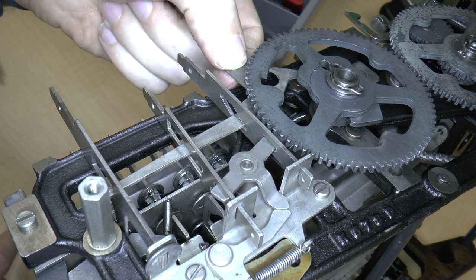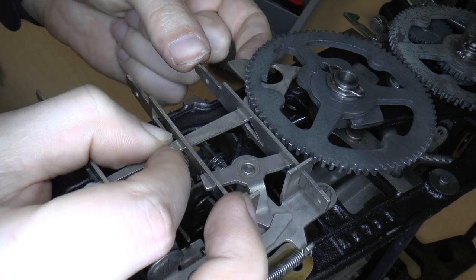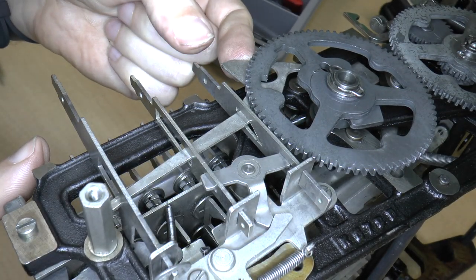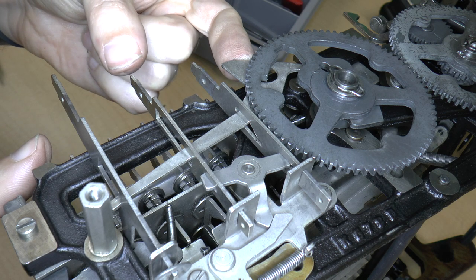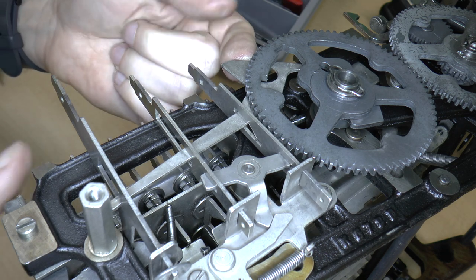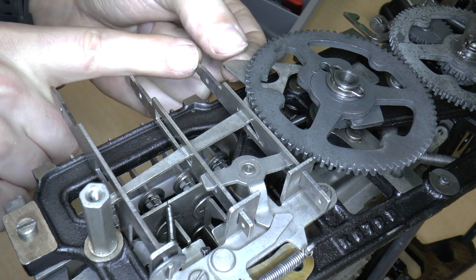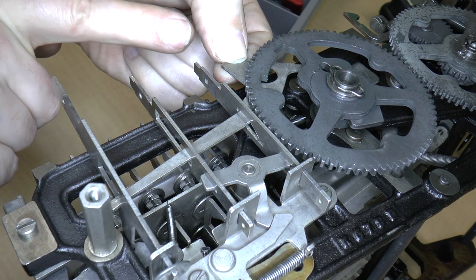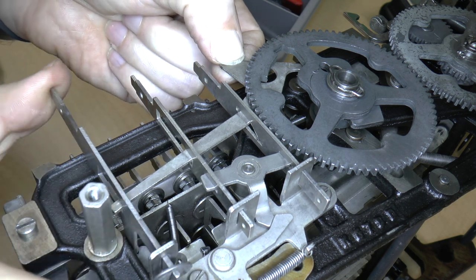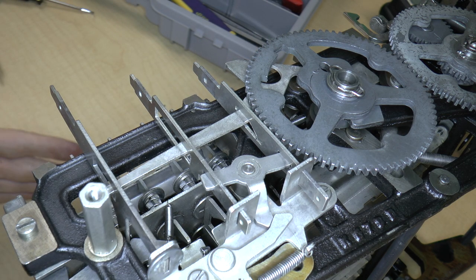Well, okay, so we'll have to see, because I'm pretty sure that if this lever goes up, which means that this key stem has to be in the down position, that allows this to turn like this. So maybe this is non-repeat, and this is repeat. I'm pretty sure that's the way it must be. So when this key is down, that's non-repeat, which means that when you run through a cycle, eventually this lever will push the clearing key down. So good. I think that's pretty much how it's supposed to work.